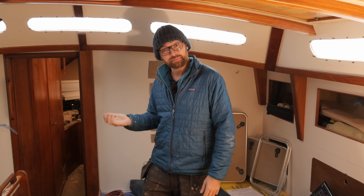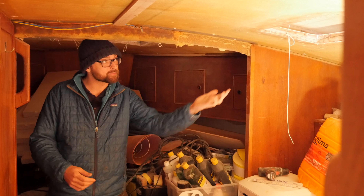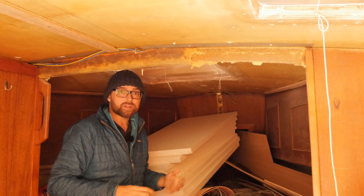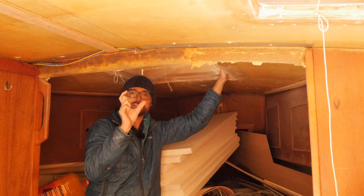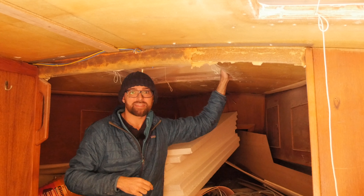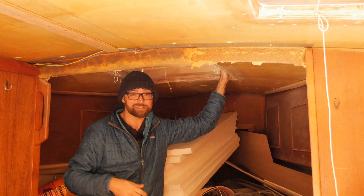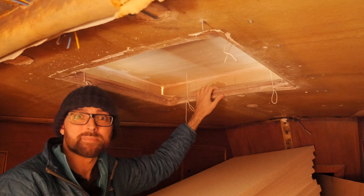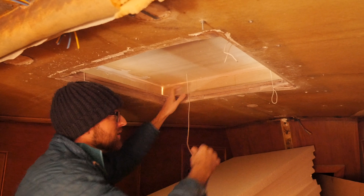Now let's head in and take a look at the hatch openings. In here in the forward cabin, there are three hatch openings: one over here, another one in the forward head, and then the big one above the V-berth. When I put on the new deck, I also enlarged the opening for this hatch by about this much, so that I can lower a washing machine down through here. A few weeks back I cleaned up the hatch openings by removing some excess fiberglass and sanding the sides, so I think we're basically ready to start drilling some holes.